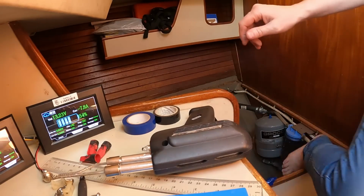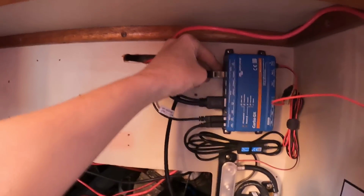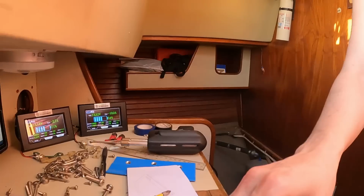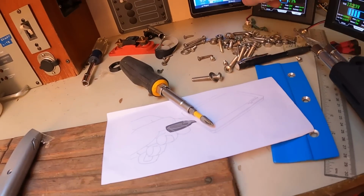So let's get this wire out. Actually, before I get started, let me make sure, is that in the VE bus? It's in VE can. VE bus. Oh, damn it, I saw the network connection and thought, okay, I bet you this is just gonna start working now. Yes, okay. I love easy fixes. It just hurts because usually they're easy fixes because I was stupid. All right, well, that's sorted. So let's go back. Inverting. All right, sweet.